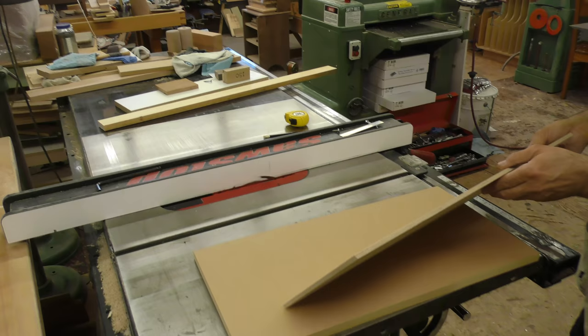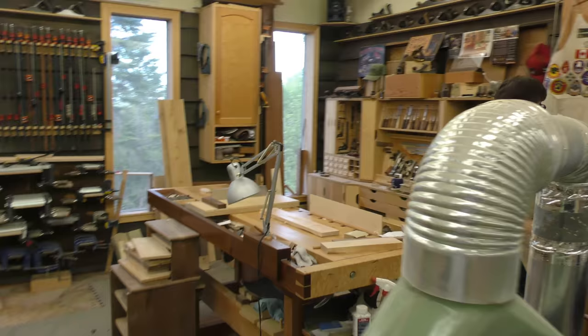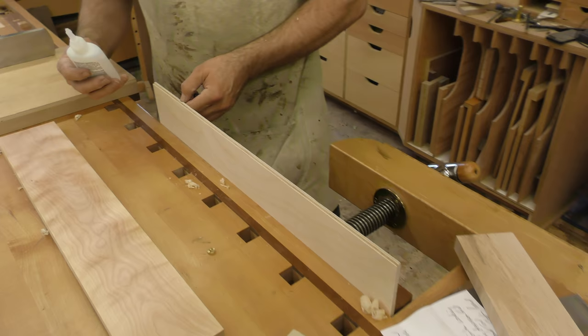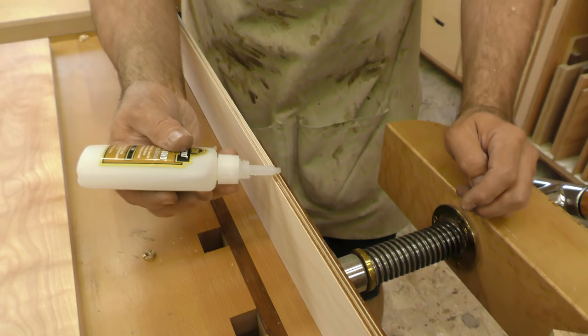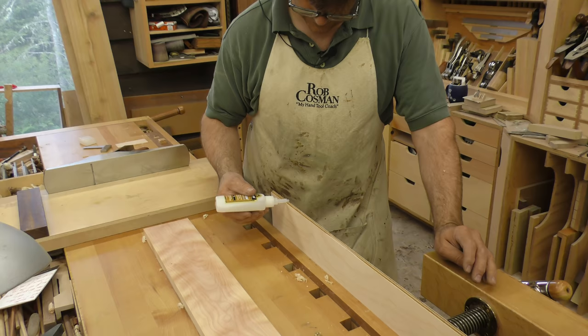So there's what we're looking at. I want to strengthen this so it'll wear better. What I'm going to do is soak this edge with cyanoacrylate, which is a super glue for wood. The one side I need to saturate is right here — this is the part that's actually going to wear. So we'll go in here and just run right along there. That'll soak and wick in there. I got this idea from watching Dale Nish turn wood — if you got into an area where the wood was punky or starting to rot, you could use this stuff and it would go in and make that otherwise soft area really hard and workable.